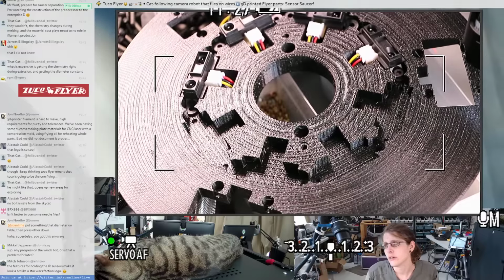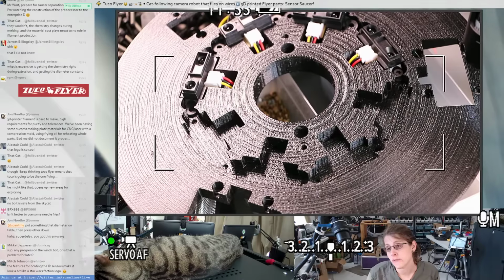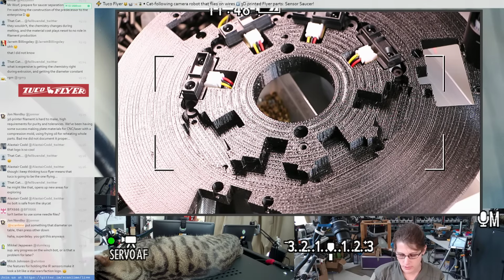The other thing on my mind is keeping it less thick. So if I decide, okay, no gearing, then it's probably easiest to keep the motor shaft concentric with the winch shaft. And then I have an idea for how to do a flexible coupler that doesn't take up much additional space, because I'm worried about making the winch bots so thick that they're hard to mount on the wall.